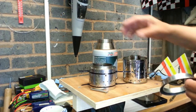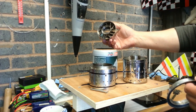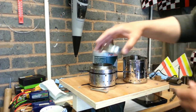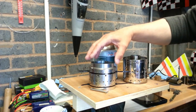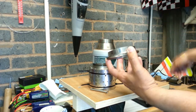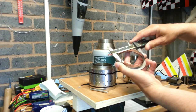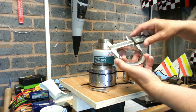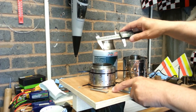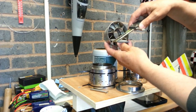This is an FD364 work in progress. You would have to make a longer back end and a bigger back end. I will just jig this up — it is a bit too big. This ring wants to be about 78mm diameter. At the moment you can see it is 81mm. But if you had about 78mm, it would sit in this cone.